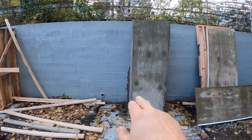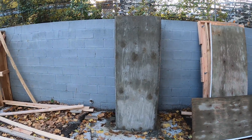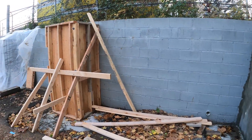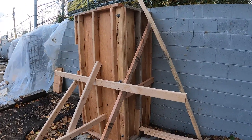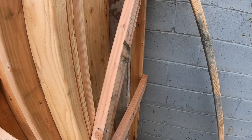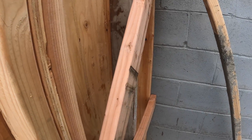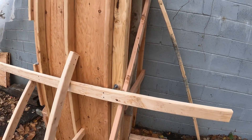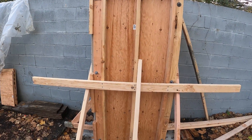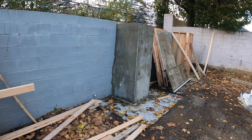You can see a little bulge in the middle, same on that side. The next three that we pour are going to have a lot more reinforcement so that doesn't happen. This one stayed pretty square just by adding that brace. My plan is to add another 2x4 here, then this brace, and probably two more of them, so it'll be braced in three spots with another 2x4 in the center. But there we go — not too bad.